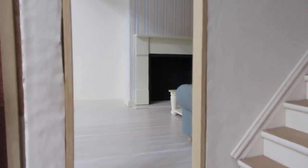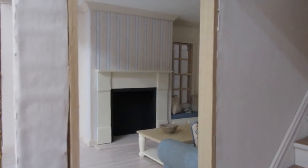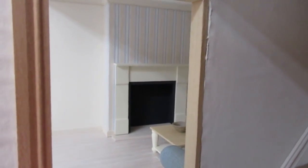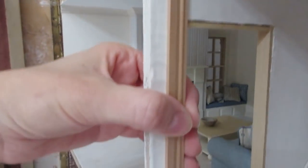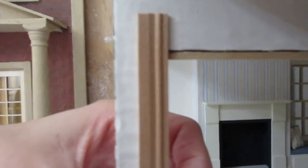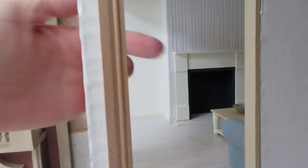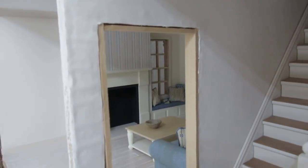You can see there are a couple of rough edges around the outside edges where my frame wasn't square after bashing out the old frame. Don't worry about that — we'll be adding a surround on the outside of the door which will cover those internal sides. I'll be using skirting board as my surround, which will sit right along the edge and cover up these internal surrounds. A nice miter join at the top will join those pieces together.